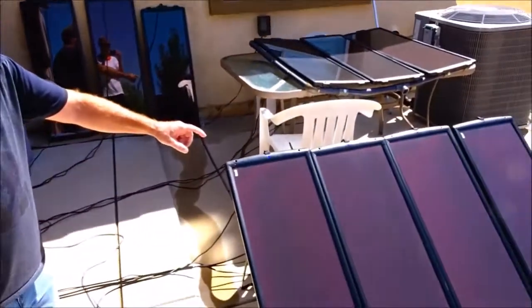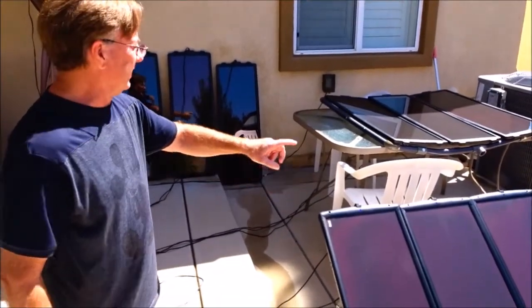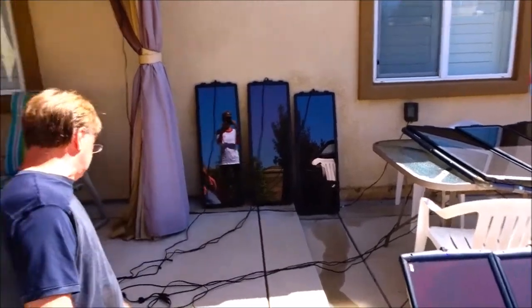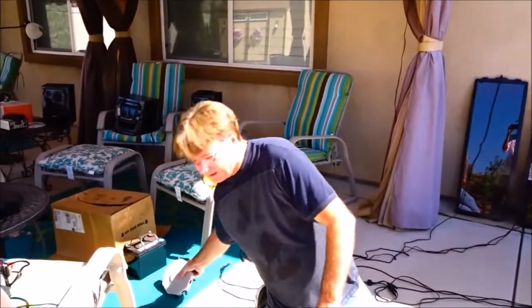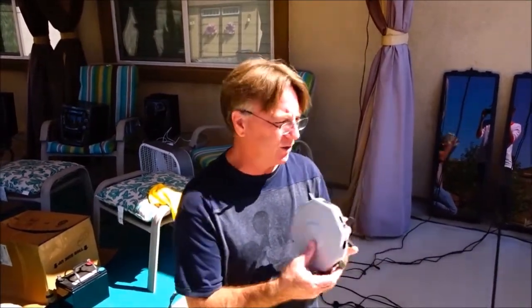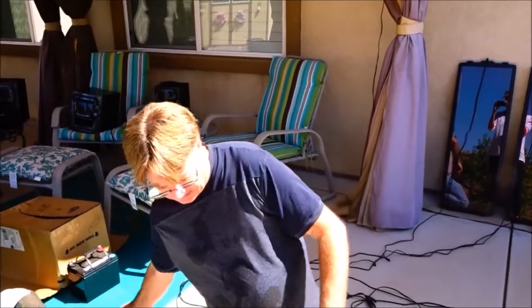So welcome back — still on the solar panels. I have four 25-watt Harbor Freight solar panels, and altogether I also have six 15-watt panels. I'm going to be mixing and matching these solar panels into the Harbor Freight hub. This hub has eight input ports and one output, and it will handle up to 400 watts. Do not put more than 400 watts into this, but you can mix and match your solar panels into this hub to combine all the wattage together.